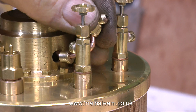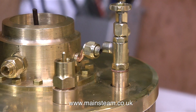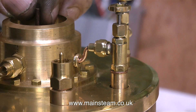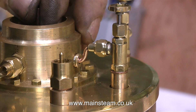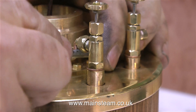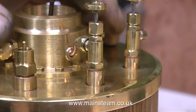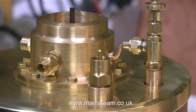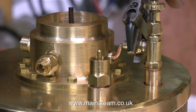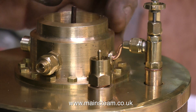This blower pipe has been a right pain to fit, but it will look good at the end. Getting the bend right was just difficult — I had to anneal the copper three times in order to keep it soft so I could bend it to shape. In case you don't know what annealing is: copper work-hardens — the more you bend it the harder it gets and it will fracture. So you heat it to a cherry red, let it cool to black, then quench in water; this softens the copper to allow you to bend it again. You can do this quite a few times. Anyway, it finally gets bent to the correct shape and the union nut fits perfectly.